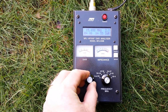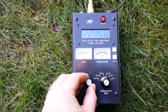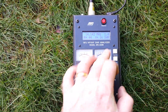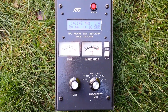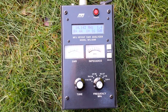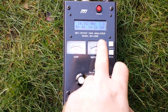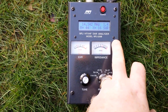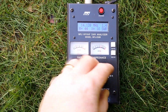On 14 MHz I can't get it to run as low as I'd like, but it doesn't matter. The lowest point is around 1.4:1 SWR — best I can manage at the moment — but to be fair, the antenna is trapped between swings, fences, a garage, and there's a metal roof on that garage. The impedance is still around 47 ohms though, so not bad.